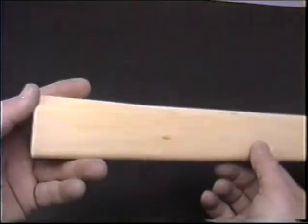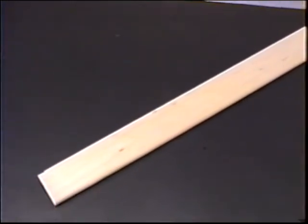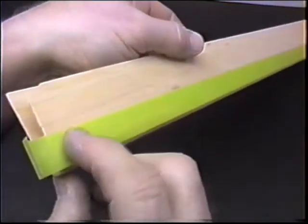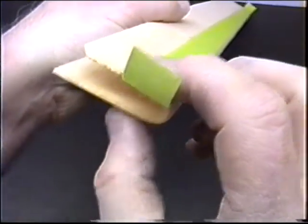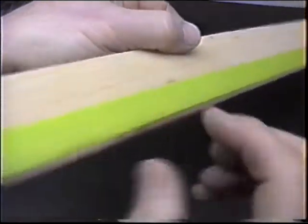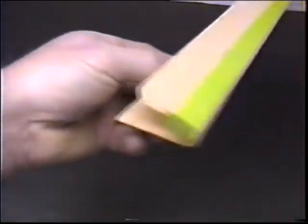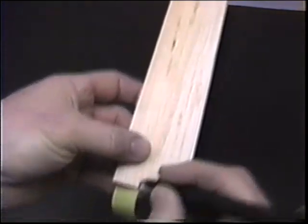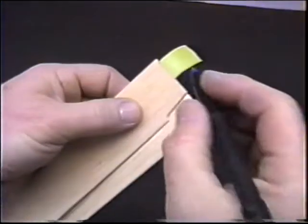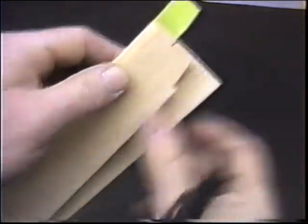So the first thing I'm going to have to do is lay this out with masking tape. Just carefully lay out so that the whole leading edge has a very even parting line. Now, it isn't real critical, and I don't need to make it any bigger than this, but I sure wouldn't want to make it right in the curve. I want to have a little bit of extra material, because we're going to have a joint that we want to bury, we want to sand out so that you can't see it. But now what I want to do is go around this piece, if possible, just do this. Whoops, I'm measuring that end. Tough to do this looking through the camera. Measure this end. Get a piece of tape on this side, and then I know I can make those cuts.